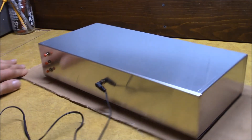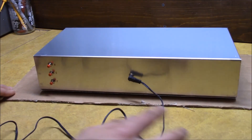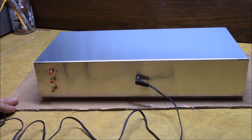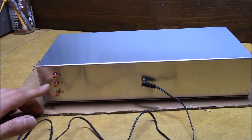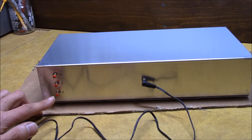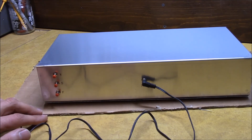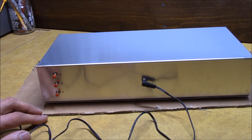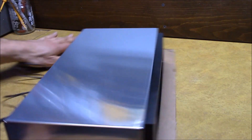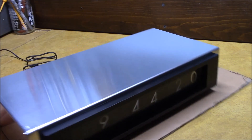Simple build, powered by a 9-volt AC wall adapter — that's your time base. You have to use an AC supply so the clock gets its 60Hz reference. Just three simple time-setting buttons: fast, slow, and hold. So I can sync it up to the 30 other clocks I have. We're out of control here, but it's a fun hobby — taking this old antiquated display technology and making it useful.